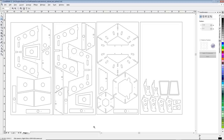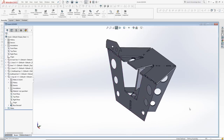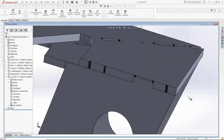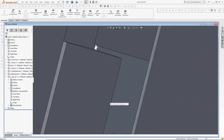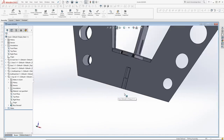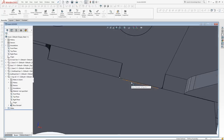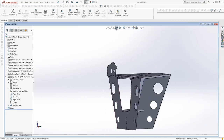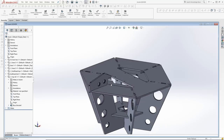I took your 2D image and extruded it to 3D in Solidworks. Let's take a look. This is a cross-section view of the main components of your design — checking things like, do the tabs intersect with the different pieces? How does this section stack up where we've got three panels coming together at weird angles? There was actually one spot where a tab was a little too long, and that was an easy fix. It's easier to fix in software, though we probably could have hit it with a belt sander. The goal is to get it fitting together right out of the machine, but it doesn't always go that way. This is your first build — every build has something that isn't just perfect, but we can get there.